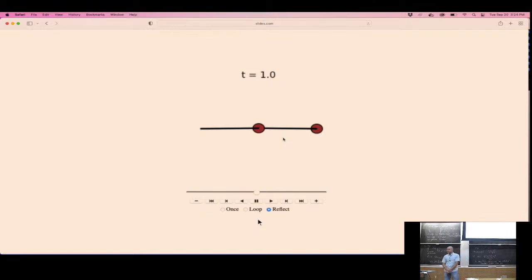Yes? So I guess say you were sitting in your lab and you're operating a robot, what would happen? And what would make this happen? Like in terms of you getting close to the singular, in practice, could you break a robot? Robots have broken because some people used simple Jacobian controllers and got too close to singularities. Yeah, and in the 80s in particular, there was a series of papers about what's the right way to do this sort of control, and they worried very much about not blowing up during the singularities. Absolutely. What physically happens?